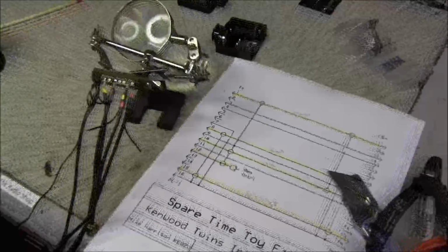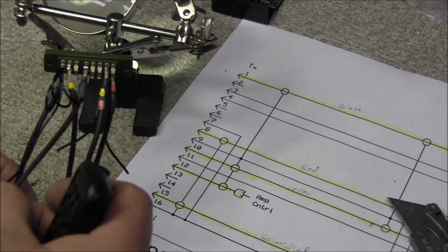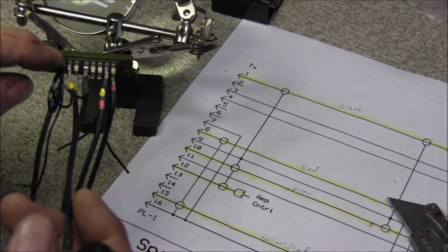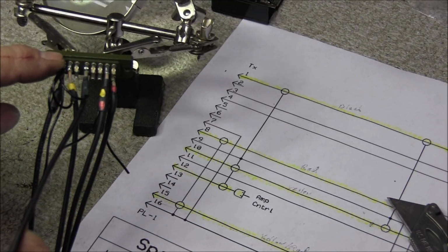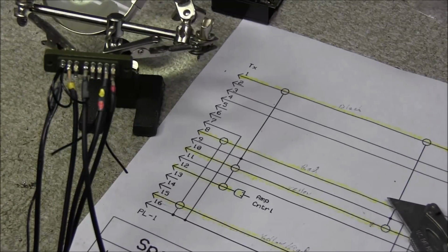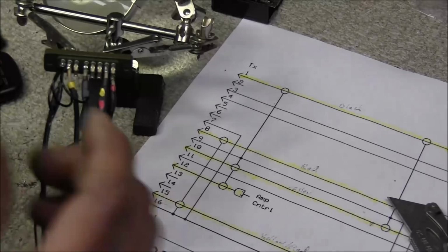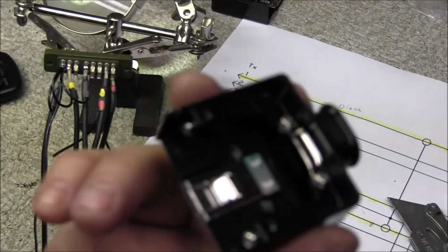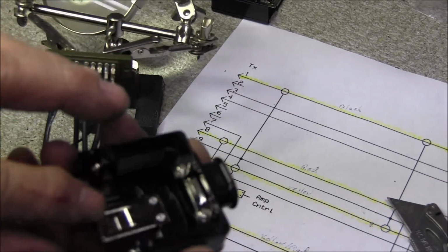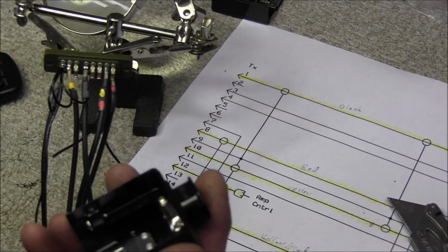Okay, we got all of those on, and as you can see, the amplifier control cable goes to pin 12 and the shield goes to pin 9 along with its straight through cable. Now, before you put the other ends on, you will have to put your cable housings on because of the hole. This doesn't open up. The cable housing comes apart, but you got to run your wires through both of them first.